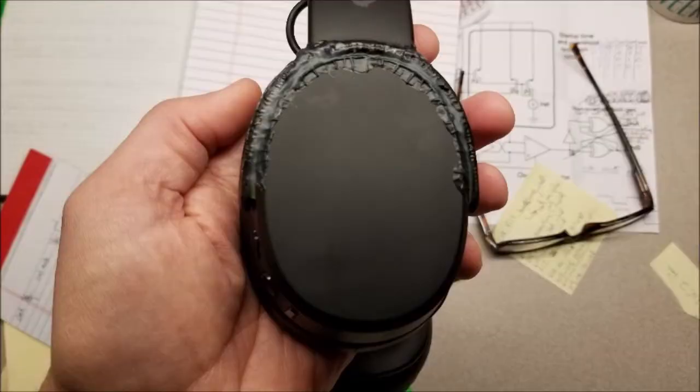This is what it looks like when it's done. It's important to work quickly. You have about five to ten minutes before the epoxy starts to thicken and set and it gets harder to manipulate. Get it into the groove as quickly as you can, but be careful not to get it on things you don't want — it will not come off. You have one shot at it, so work carefully but keep it moving. Be careful about the amount. How nice it looks when you're done depends on how quickly you get it in there and how uniform you can make it before you let it set.